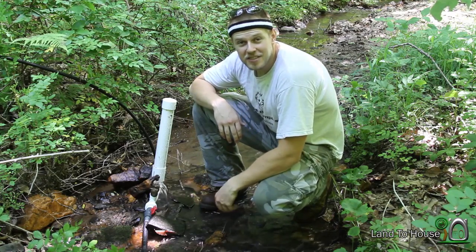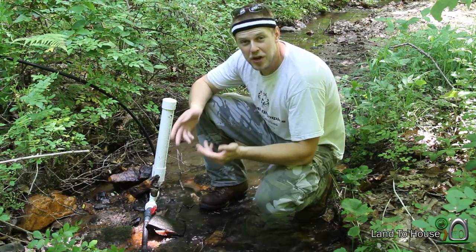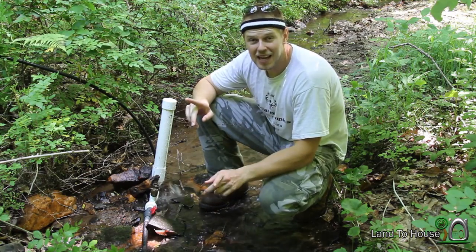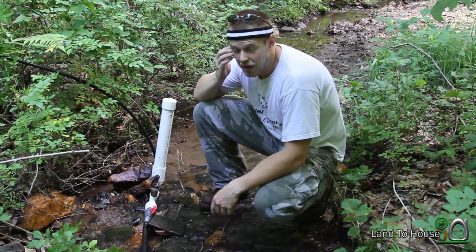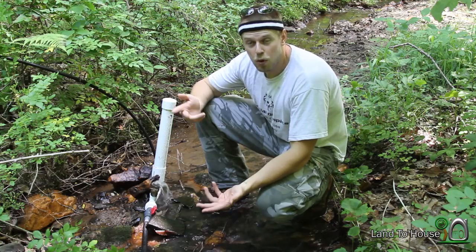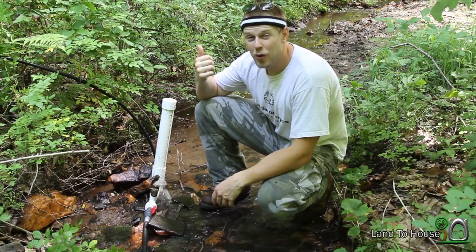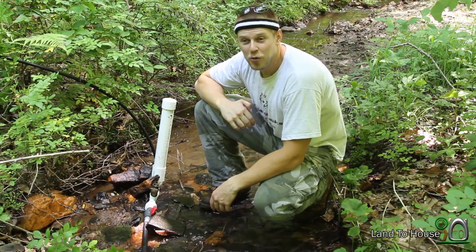So that's actually the first time I've ever installed a standpipe and a supply line. People tell you you have to have this ratio of 3-2-1, but basically as long as your standpipe and your supply line are bigger than your drive pipe, you're good to go. And when I mean bigger, I mean at least double size, maybe even more. Adding that six foot of head really makes a difference.